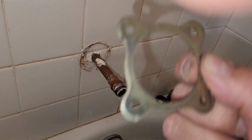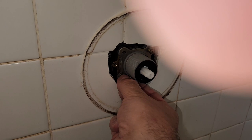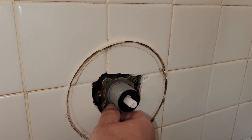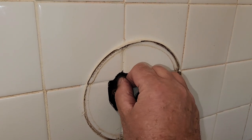We're going to grab the four screws that go with it, and we're going to hand-tighten the screws down. We're not going to tighten each screw tight as we go — we're going to snug them down and then go in a crisscross pattern, slowly tightening it in nice and flat so that we don't damage the O-ring that's going to seal the valve to the valve body.